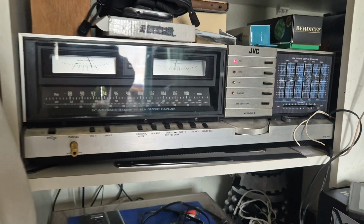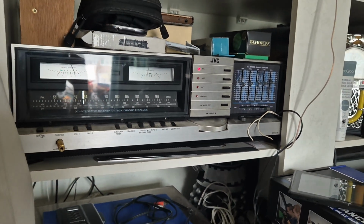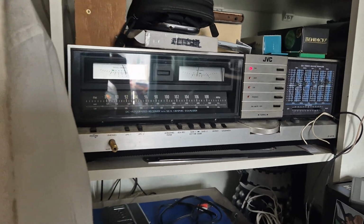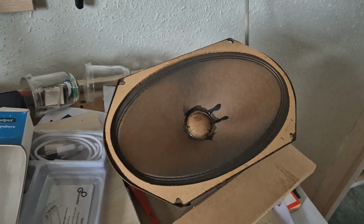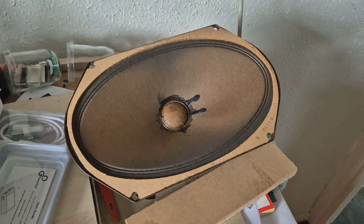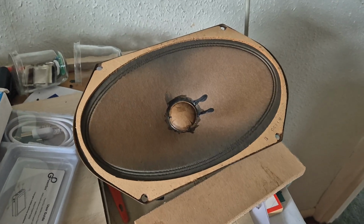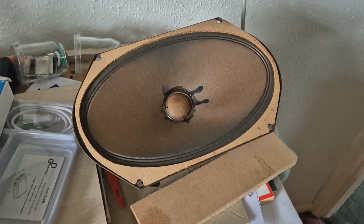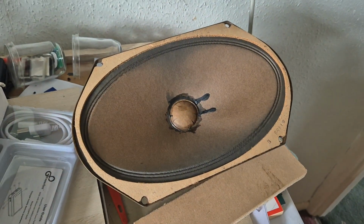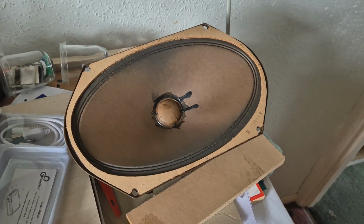Which is a lot of power, really, more than the radio would put out. So its top-end volume on that one EL81 valve would not be terribly loud. Yeah, it would work, but I'm interested in what other people might think. I mean, the purists would say replace it. Some might say try and increase the magnet strength or change the magnet for another one. But then I'd have to tear all this apart again, and I don't know how much more it would survive. I've got a working speaker out of it, but I want to run with the replacement.